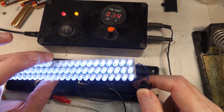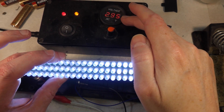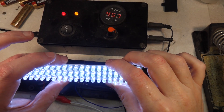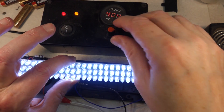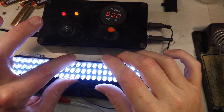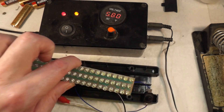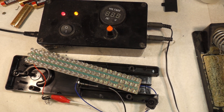I'm just wondering if it's just duff batteries, because the board is working fine — it's only running at three volts. Let's turn that up slightly to four volts. Interestingly, that LED that was out has now come on. At five volts it's very bright. So this is definitely working. I've got a sneaking suspicion this is just a dirty contact or some duff batteries.